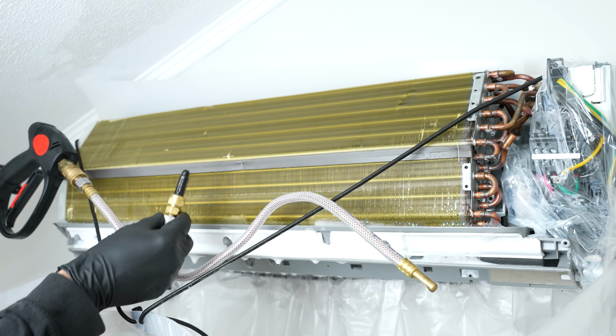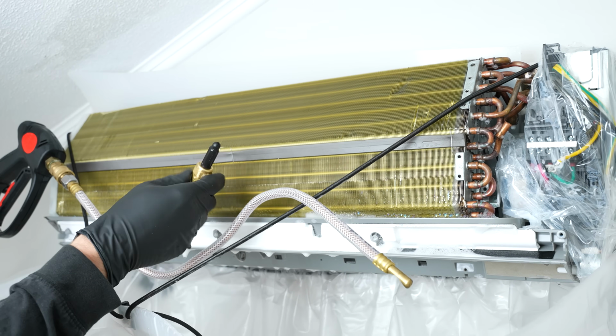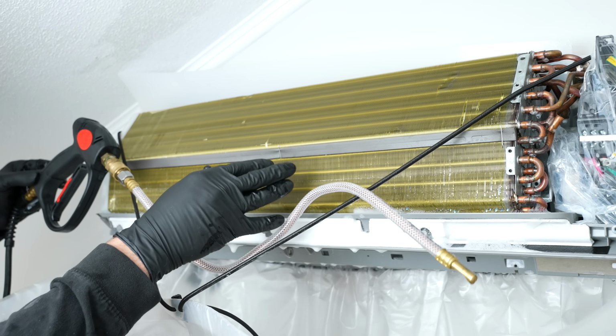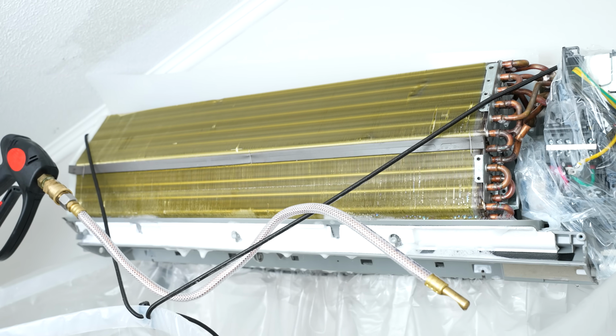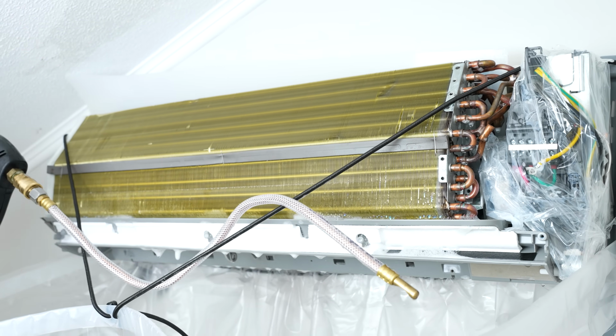So when you're cleaning in here, you're probably gonna want a bubbler and then this extension hose anytime you're inside the building on the wall mounted units. And so now we waited 5 minutes and we have our extension hose. We're gonna go ahead and spray this off with water. We've turned our knob down to 0 from the 20:1 ratio.